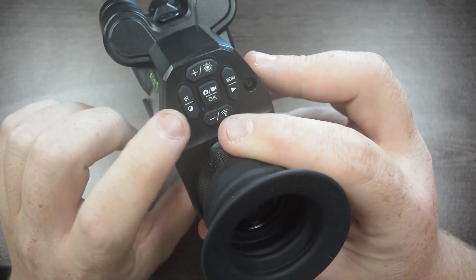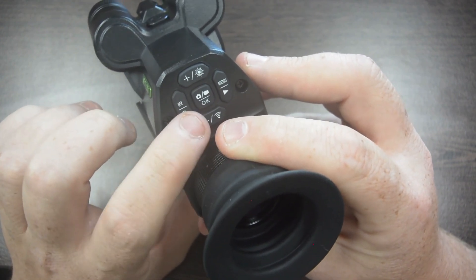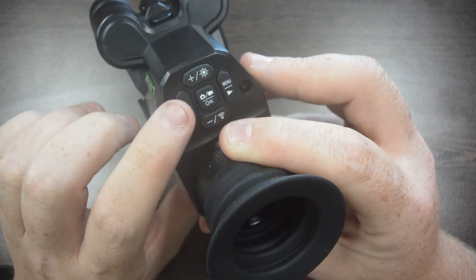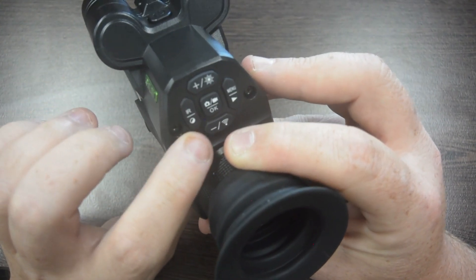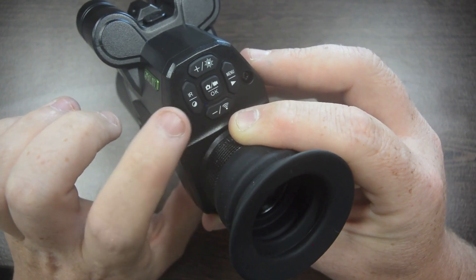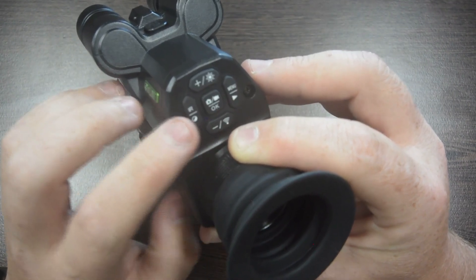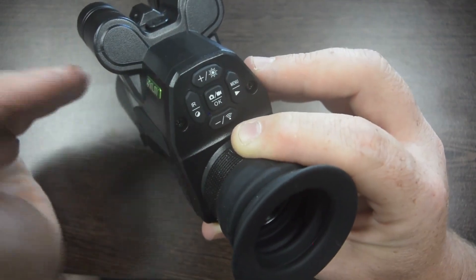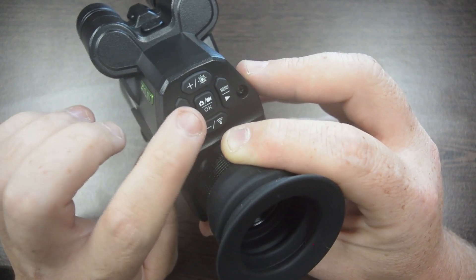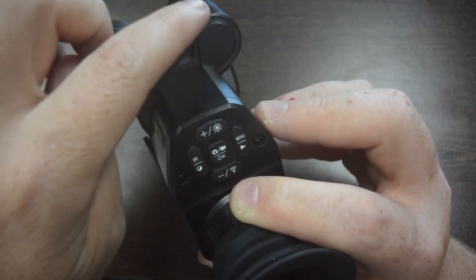On the left here you've got your IR. This will also change it from day mode into night mode. To go from day mode to night mode, just hold this down, you'll hear a click, and it'll change from colour — which is day mode — into black and white, which is night mode, or vice versa. When you are in night mode, if you do single clicks of it, it'll go through the illuminator power — each illuminator has three power settings, so it will scroll through that. If you double click on this, that's how you change the settings from using either the 850, or the 940, or using both of them together.